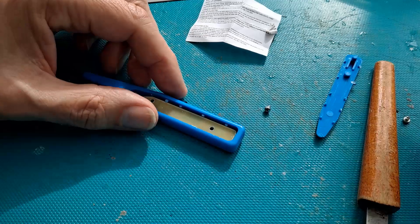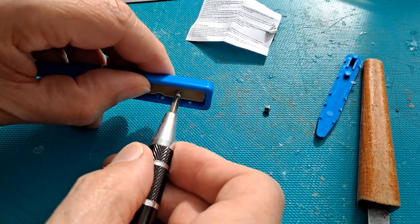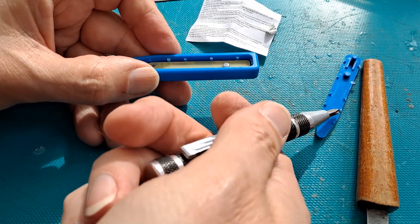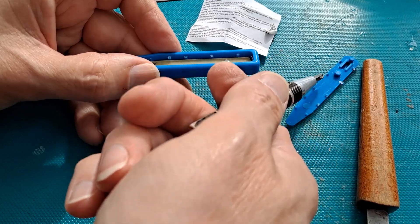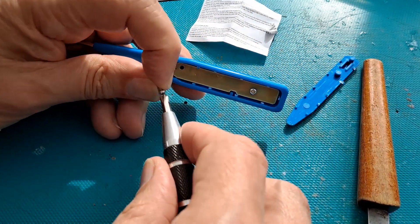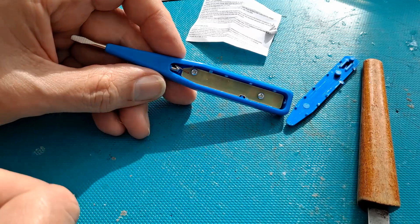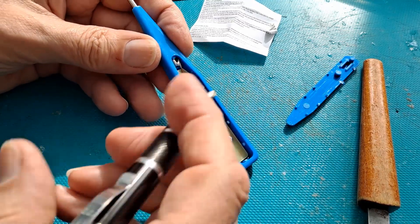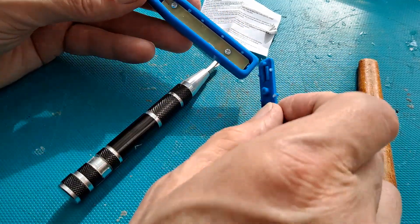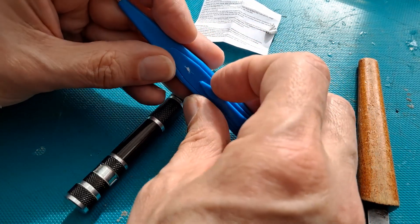Well, not a lot going on there. And I can see where I've levered that up, it was either glued or heat welded in some way along those little tags, because that's all broken along there. So no doubt now it's unsafe because you could potentially get hold of that bit when it's touching the live terminal. But I think the fact that it just fell off straight away — I guess what I ought to do is run some glue along there so it doesn't come apart when I'm playing with it.